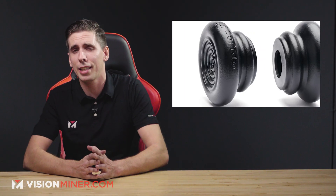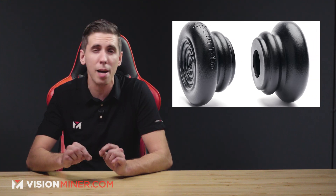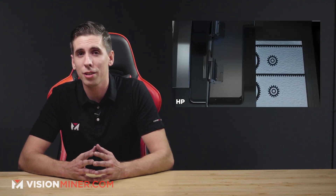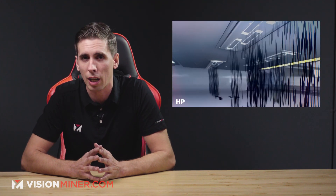Next, Evonik and HP released a new elastomer — a high-performance flexible powder for additive SLS-type processes based on a thermoplastic amide, TPA. It's flexible and lightweight, characterized by super low density, with a Shore A hardness of 91. So you get a light, flexible, and tough part — pretty cool stuff.